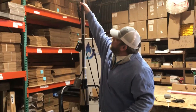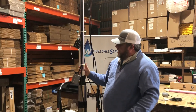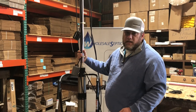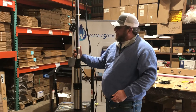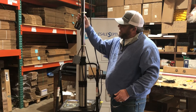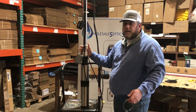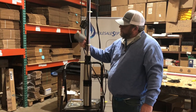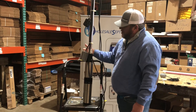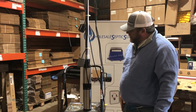Run all your wires nice and clean. You can get any of these floats at our website — there's a link down below. We'll go over in another video what the floats actually do; this one is just about placement and why. You don't want them hitting each other or tangling up, and you don't want too much lead on there because you don't want the pump to cycle for a long time.